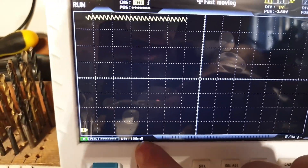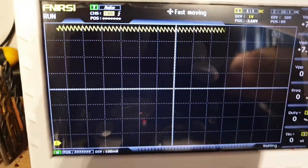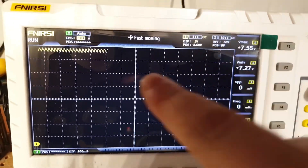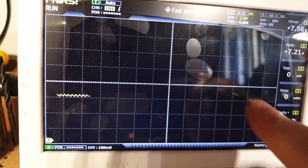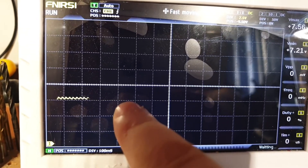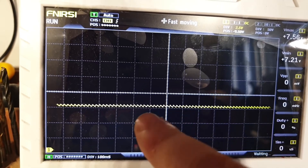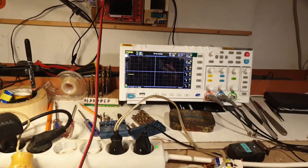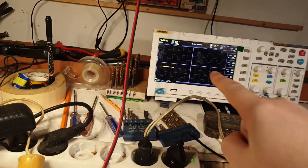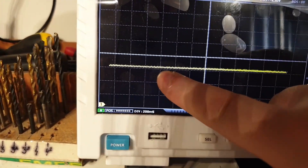I'm powering the transformer now. When I connected this resistor back to ground, I got this very clean waveform — a single line right in the middle. At 100 milliseconds I'm getting a very nice squiggly line. Even though it looks jagged and triangular when zoomed in very close, it is actually continuous — it is a straight line, not a sinusoidal waveform like before. This is the correct, continuous waveform. The slight zigzag is because of the capacitor value.